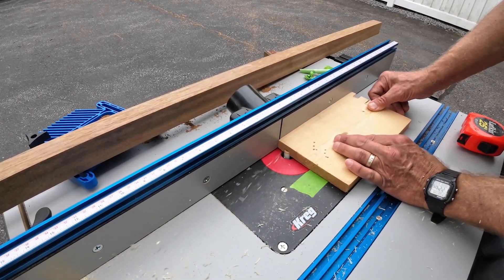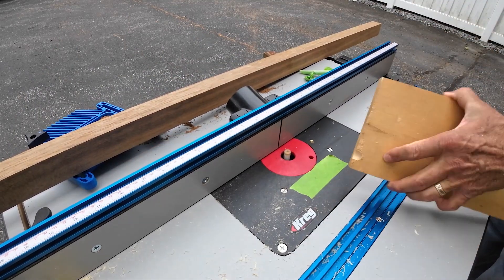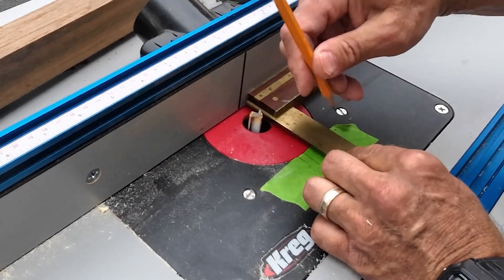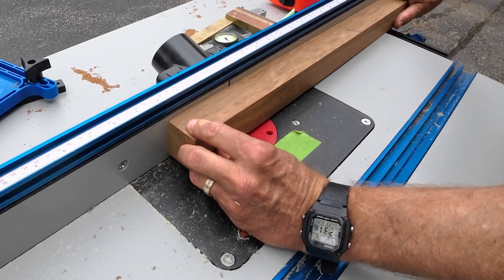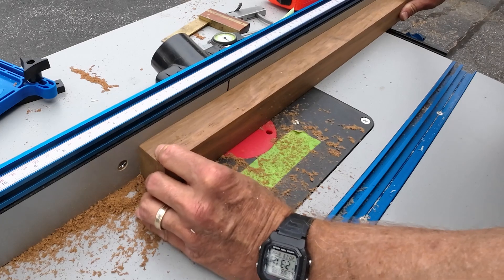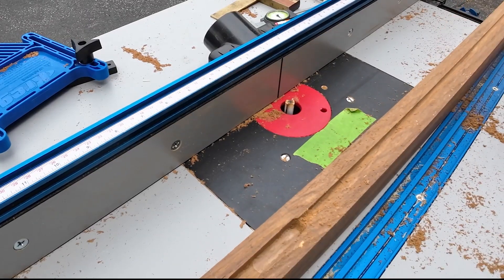Now I'm checking square on a half-inch straight bit, which we'll use to cut the groove for the trigger mechanism to sit in. Once you get it lined up in the center, mark each edge. Since this is a straight bit and it's going to be a blind cut, you have to seesaw it in to get it started. Make multiple cuts taking a little bite at a time — about three-eighths of an inch at a time until you reach about 0.9 inches deep. Make sure your marks are lining up with the outside mark of the bit each time.